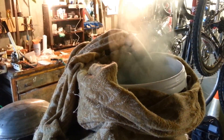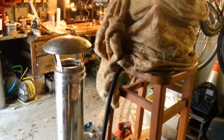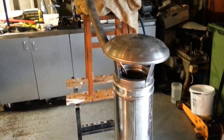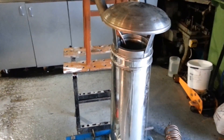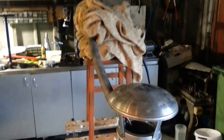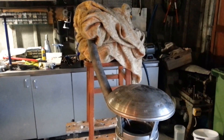You can really see the heat coming off that water there. No power leads — it's all just natural convection. The copper coil being used actually has fins around it — five fins per coil — just to act as an extended surface to increase the heat transfer area. I've been recording the temperature and it's taken about 50 minutes to get it to 75 degrees. I think it's just starting to hit an equilibrium point — it might get to 80, but it seems to be settling around 75 to 76 degrees.